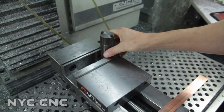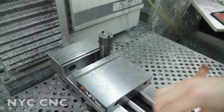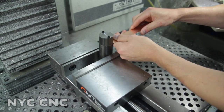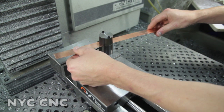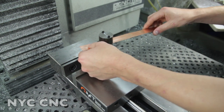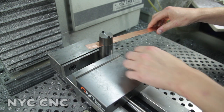I'm going to put this in the vise just so it holds steady — we're going to see how our copper strip fits through. Perfect. It slides through with no problem but doesn't have too much play up, down, or side to side. I think that's going to be good. Let's get this on the lathe and see what the runout looks like.